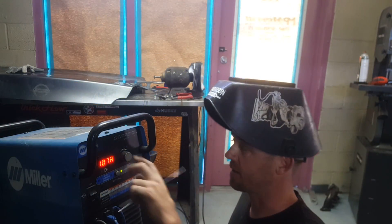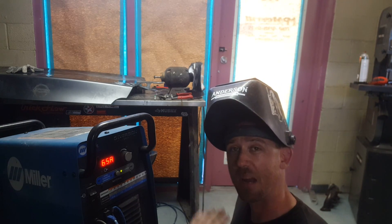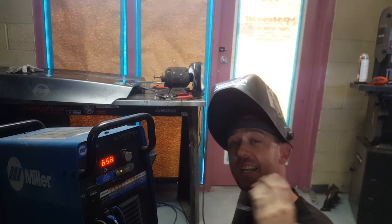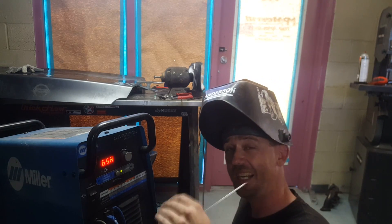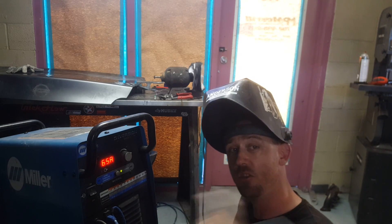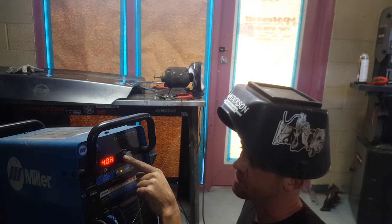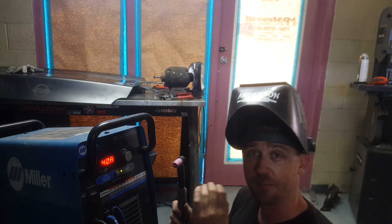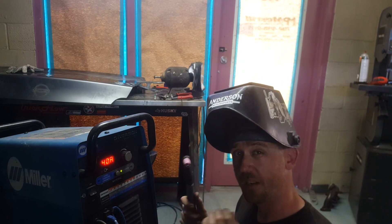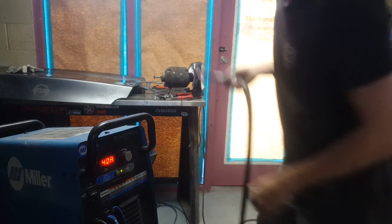Now that trunk is really, really thin. I don't have any accessibility behind it to get a chill block or any kind of backing metal into it, so I'm going to have to freehand this and weld around the hole. I need enough amperage to heat that metal up quickly and get the rod filled in to penetrate fast, but not so much heat that it blows the hole wide open. I'm going to start around 40 amps. I've also outfitted my 9F torch head with a 1/16 inch tungsten and I'm using 1/16 inch filler rod. This should be enough to fill and build it up quickly around the edge of that hole.